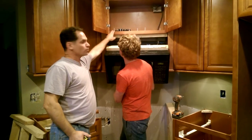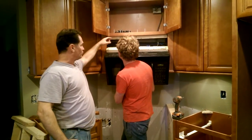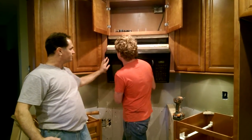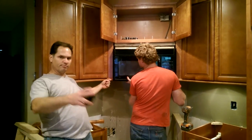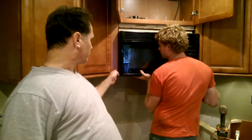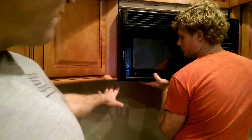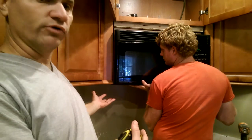The other thing we dealt with is they didn't have a 21-inch tall microwave cabinet, only an 18-inch. I wanted my light rail molding to come across and not show. The way we finished it out, the light rail molding dies right into it — otherwise we'd have to try to return it back if the microwave was up three inches, which would look weird with the open angles.